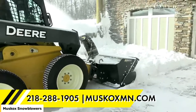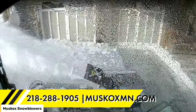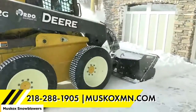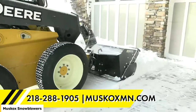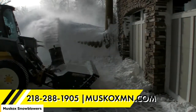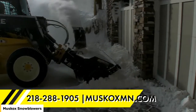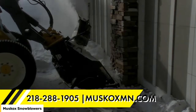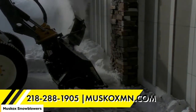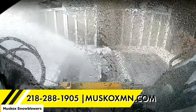Now I'm going to show you the back drag mode. You can see I keep the blower down as I'm moving forward. And when I get close to a wall or a door or whatever, you can see I'll start rotating the chute slightly back and then lifting. Now you can see, I can see the front cut edge. There I go, and I'm lowering it right by the building, rotating down until it contacts the front edge, then back dragging.